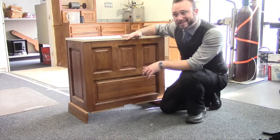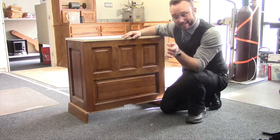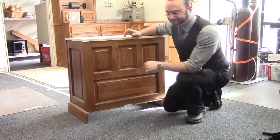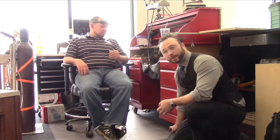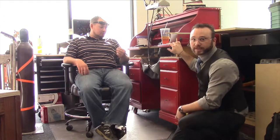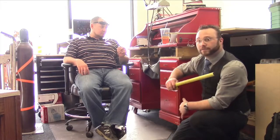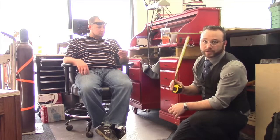I need to measure where the top needs to sit vertically, as well as where the actual bench top itself needs to sit vertically. What's important to know is the distance from the ground to the inner top, and of course the distance between the ground and the actual work surface of the bench — everything else will work itself out. These benches have to be built to their primary user. They're designed to be worked at for hours at a stretch, so it has to be built to the correct height. Since John will be the one working on it primarily, we have to build it to him.